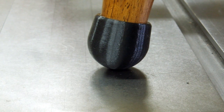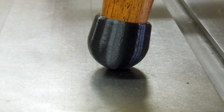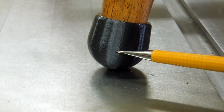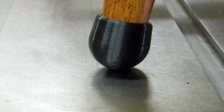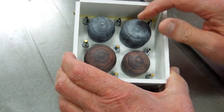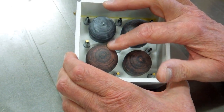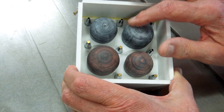These were printed with 20% infill and it took 10 or 12 hours to print four for one chair — I don't think at 20% infill these would hold up that well. At 100% infill it will take a day and a half to print for one chair. So I intend to make a silicone mold and cast them with the same type of resin I used for the conductor — that stuff is tough and the service life will be very good. I printed these at 0.1mm layers; there were some ridges which I filled with epoxy sculpt, then chucked it on the lathe and sanded it smooth.